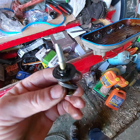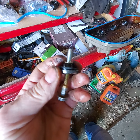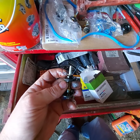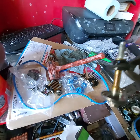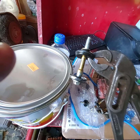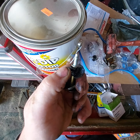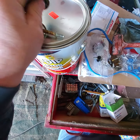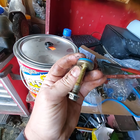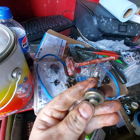To replace these grommet washers or seals, separate your little cup washer from the seal, then grab that rubber with a pair of pliers and give it a twist to break it. You could probably use a knife or something. Stick your new one on there — that rubber should be soft enough that you can push that little shoulder right through there. Just like that.